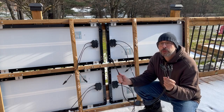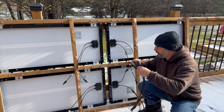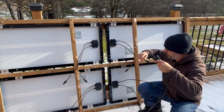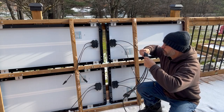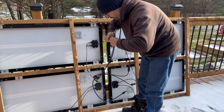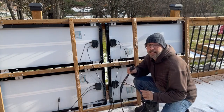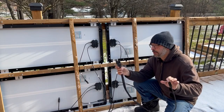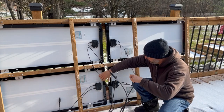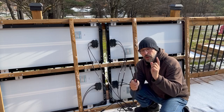In addition to the 800-watt system I also purchased 4-to-1 connectors to connect all my panels in parallel. It's very easy — basically plug and play, only connects one way, and they just snap in. Snapping all four in leaves you with one connector to run back to your solar charge controller. You use another 4-to-1 connector to do the same on the negative side of the panels, and that leaves you with two easy wires — one positive, one negative — to run back to your solar system.